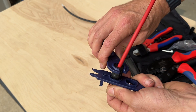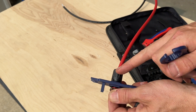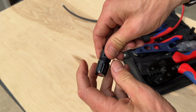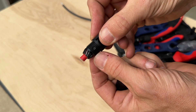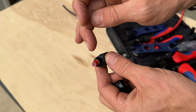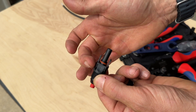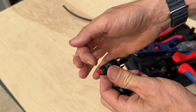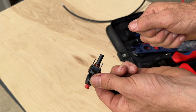What you're doing is compressing that grommet down so it makes a weather-tight seal around your cable. I have an example I cut off earlier — if we take that cap back off you can see how that grommet compresses around the cabling, which keeps water from coming in from this side. Then we have an o-ring over here, so once we have our female and male ends connected we have an o-ring seal here and a weather-tight seal from the grommet, keeping water out of our metal contacts.